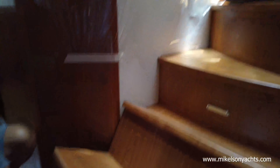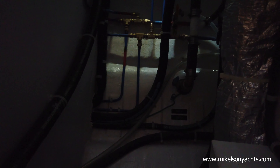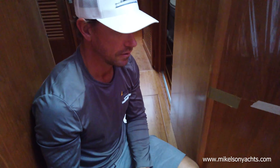Under here it leads to the area where Jorge is working, the lower part of it. There's a dryer vent — good call. All copper plumbing back there. We never cut and splice spare pieces — any run is going to be a solid piece. A lot of competitors will just take whatever's left at their factory and make it a giant Lego piece, but that creates the potential for leaks in the future. Ours are all flare fittings — it's done right. It costs a little more to do it that way but it's the right way.